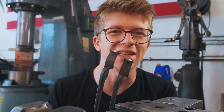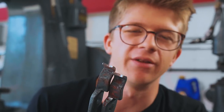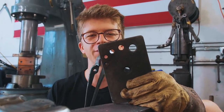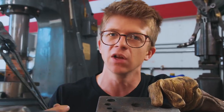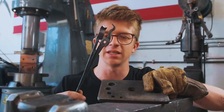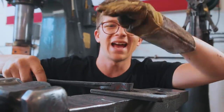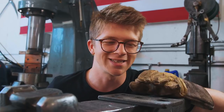As I finish up the jaws, I'm now going to prepare our rivet. This is a piece of quarter-inch round bar. Each side of the rivet head needs one and a half times the diameter of the rivet itself. I've put a little notch in the tips of our jaws — it helps give them a little extra versatility and grips different stuff when needed. I now have a plate for drifting through, about three-eighths of an inch thick, which will work great for our quarter-inch rivet. We'll set the tongs over this, drop the rivet the whole way through, head the top, flip it over, and head the bottom with it being nicely supported and spaced by this plate.